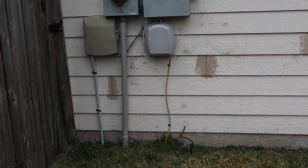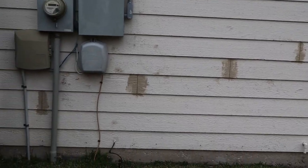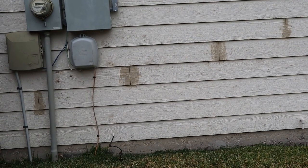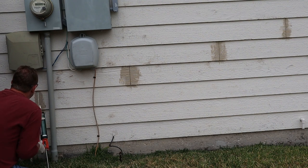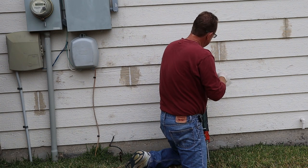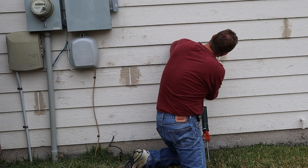As you can see on this side, we got a lot of cracks that had to be dealt with, almost every seam taken care of. And again, like I said, it's because this side over here gets sun all day long, so it gets a lot of expansion and contraction action, and I have much bigger gaps on this side to fill. Trying to squeeze it all down in the crack so I have very little to wipe. You get kind of the hang of how fast to go with the tube, how hard to press. Like I said, if I wanted to just smear and go, I could, but you know, no concave to it.